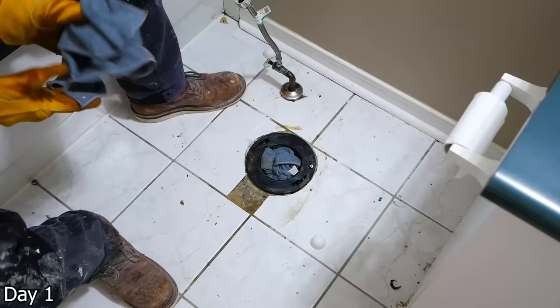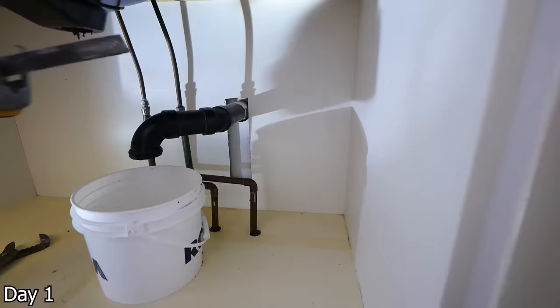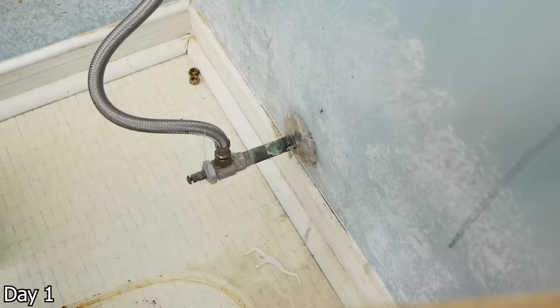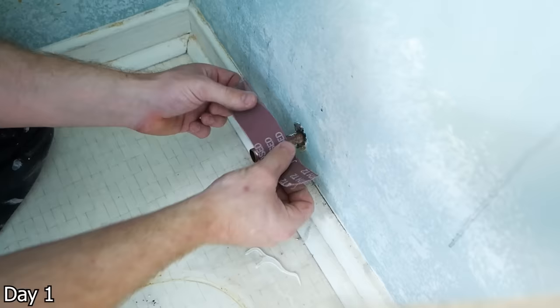This is the sink drain below the vanity. We want to disconnect all the plumbing from the countertop, starting by loosening a couple of nuts and getting the trap out. If yours doesn't have that capability, you'll have to cut it out. Where it comes out of the wall, cut that with a fine tooth blade on the reciprocating saw and put a cap on it to stop any sewer gas. Our water lines here do not have shutoffs, so we're going to cut them out — even if yours did have shutoffs, I'd still recommend cutting and replacing them. Use a pipe cutter to go around the copper line until it comes off, take off any escutcheon plate, and clean it up with emery cloth to get rid of any old residue.